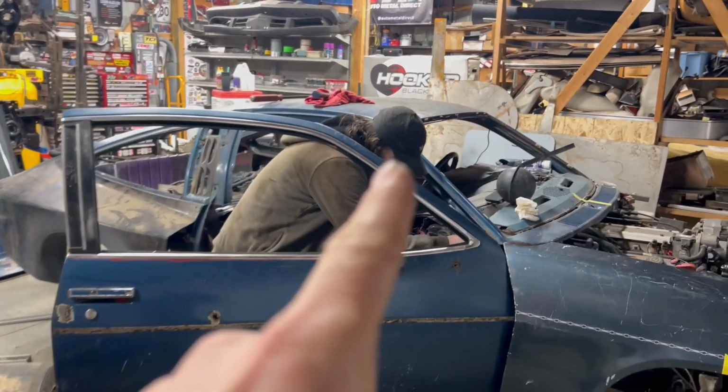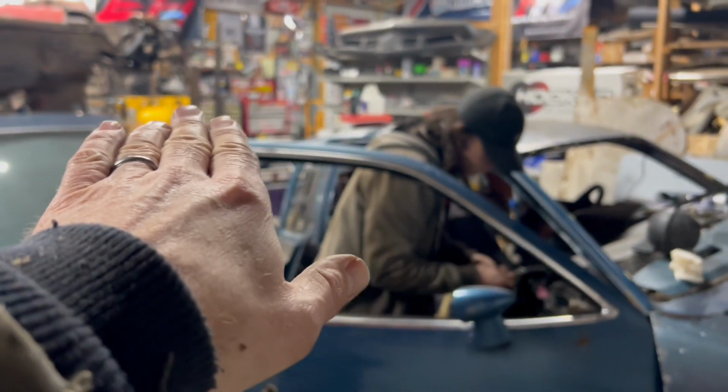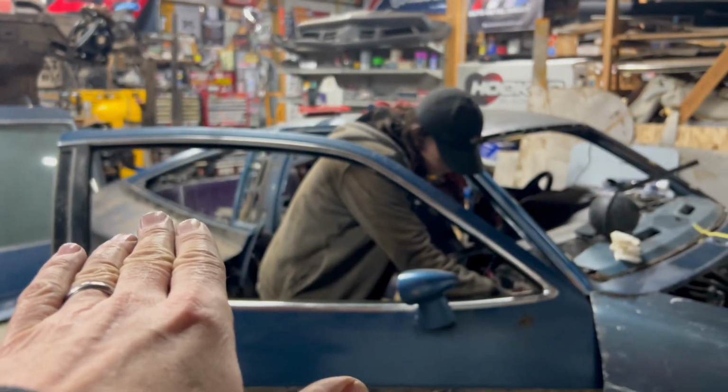So we're at the point where we make that decision now, and not have to worry about 55 other domino effects later that this body being too far forward causes. It's a really simple fix. There are only two tabs bolted onto the front. There were a couple tabs on the roll bar, but the travel home broke the tack welds. The point is, it's super easy to move the body of this car back a couple inches right now while we still can.